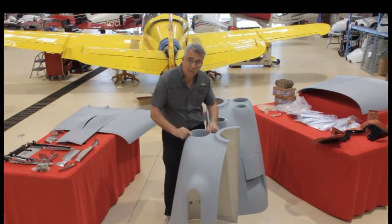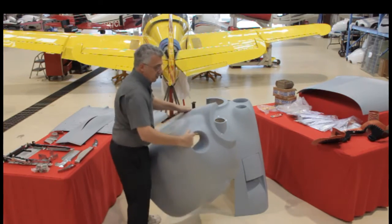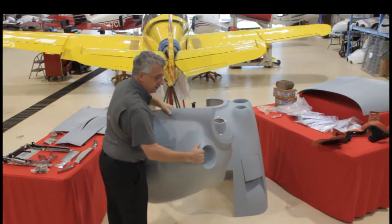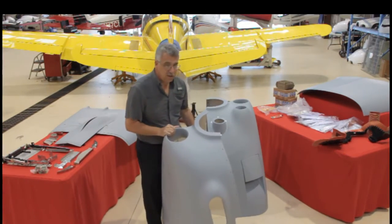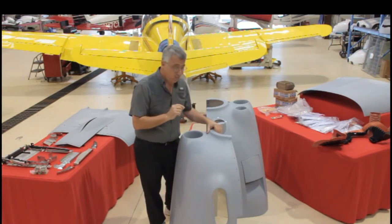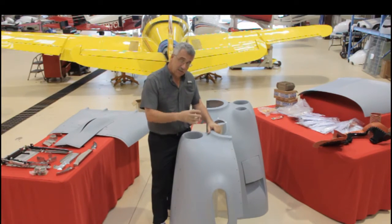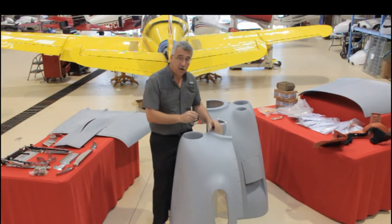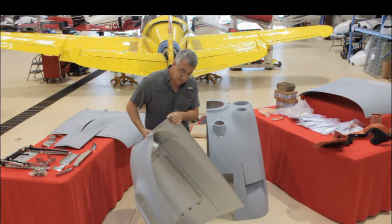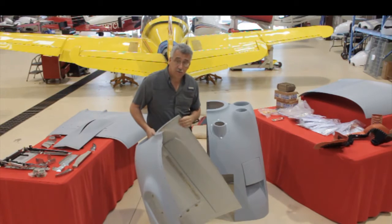The shape of this lip makes a big difference. The inlet is very close to behind the propeller blade — we did that for a reason. There's higher energy air behind the prop, and you've got to get as close to the back of the propeller as you can. We are a half inch away — that's as close as the regs will let us get. So we're taking advantage of that higher energy air to make the cooling more efficient. The cowling is a carbon fiber and fiberglass laminate, and we encapsulate that carbon in glass to make sure there aren't any corrosion issues.